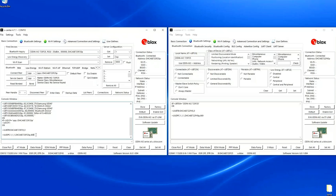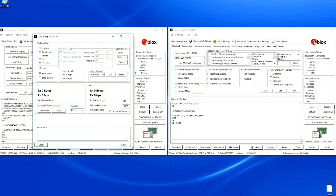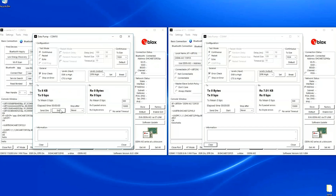You go to data mode and here you can send data — 'hello' — both ways. If you want to use a higher data rate you can use the data pump feature, which will simply start a stream of data as fast as possible. This will be limited to the UART baud rate, which is 115200.